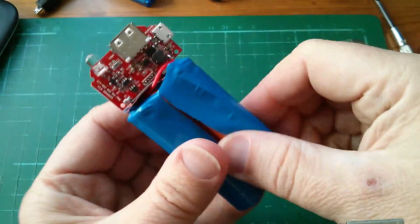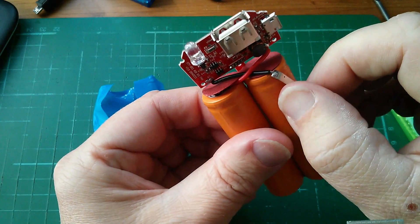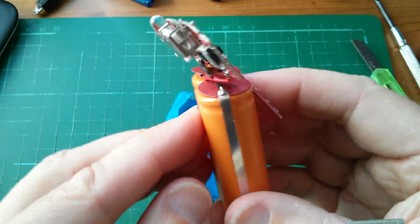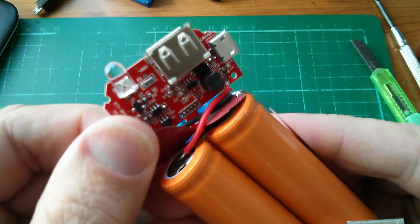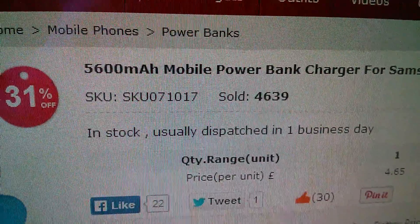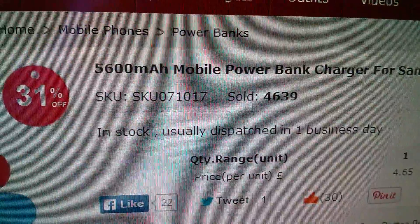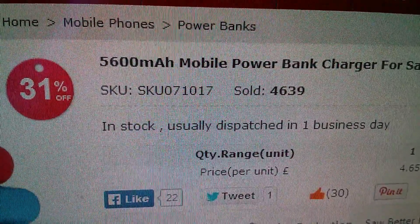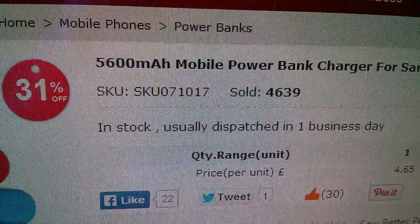But what about these cells? I'm going to have to cut this open. Let's see what you get for your four pounds. The cells are unmarked. There's a negative strip spot-welded onto the two bottom negative connections, and the positive is linked across with another bit of tab. These cells are not giving away what they are. According to Banggood this is a 5600mAh mobile power bank, which means each cell would be 2800mAh — do we believe that? Also, is it specified at 3.7 volts or at 5 volts? I think I'm going to have to measure them.